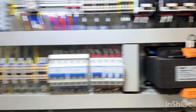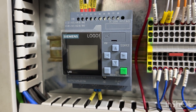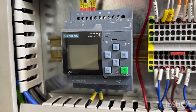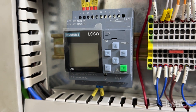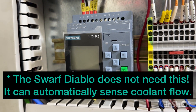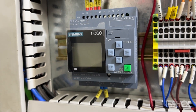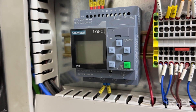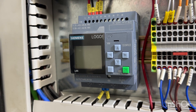I'm using a Siemens LOGO — these are new to me. I bought one to try out and honestly I can't believe they exist; they're like a hundred bucks and it's basically a tiny programmable logic controller. Normally we make all our own electronics, so originally I thought I'd have to design a circuit board and program it to do everything. But this little Siemens LOGO is the coolest thing — you don't even need to know ladder logic; there's a diagram mode that just couldn't be easier.